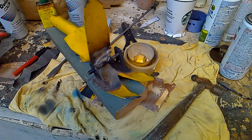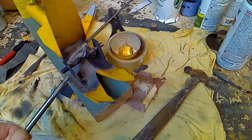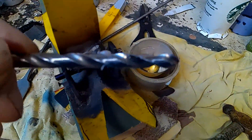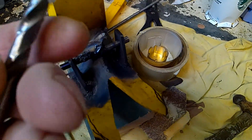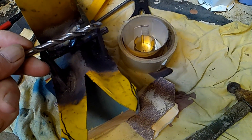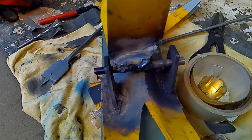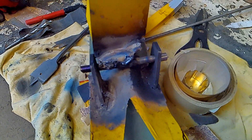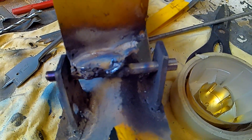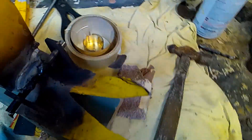So I tested out the weed puller and it did not work. What happened was the shank broke here. I used a drill bit, not realizing - I was thinking the whole drill bit was round, but actually it's round here but gets really thin. So when I welded it, the welding just burnt right through because it was just a thin drill bit. Also the amperage was way too high, so I turned it down and used a full shank this time and redid it.